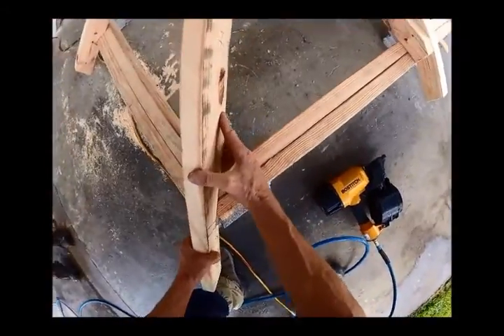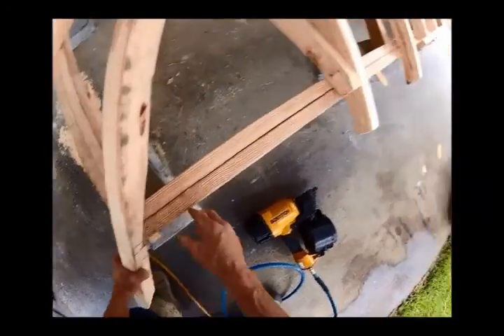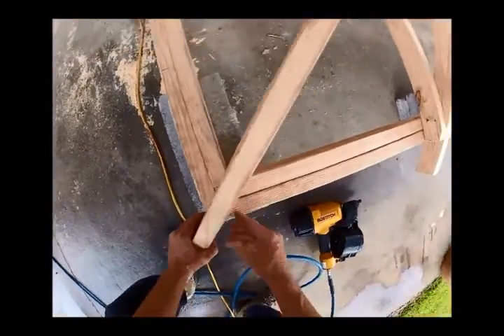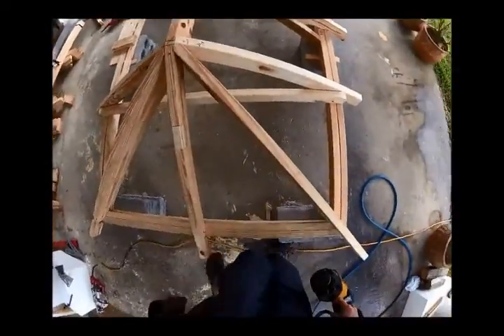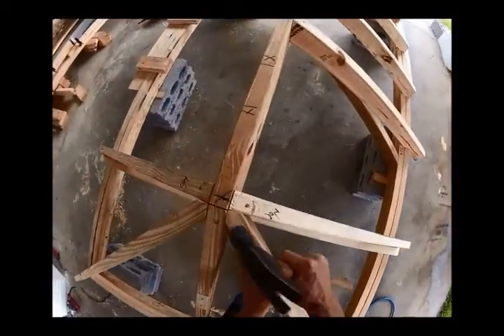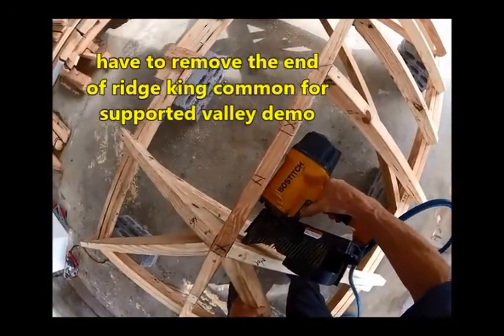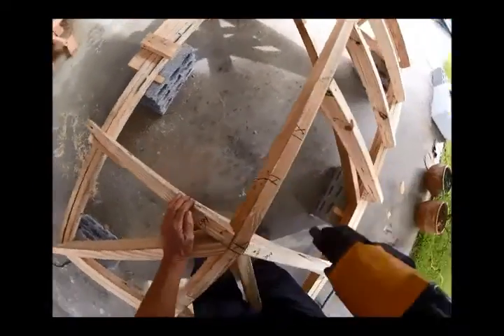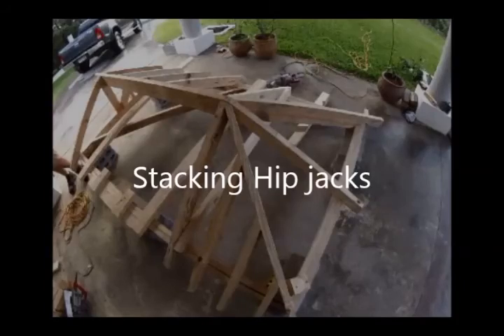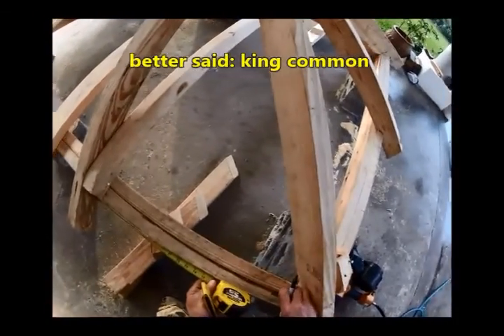It's got our two lines — I'm just going to line it up one side and the other side. So that's where our heel stand, common rafter heel stand, comes right across. Equal — heel stand in common rafter right there, in good shape. Now up at the top, just tap it down until you flush right out with the common on this side and that side. Remember, this is the side that we were going to step off eight inches from the common rafter, so let's go ahead and do that.